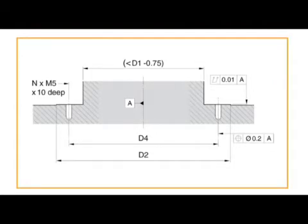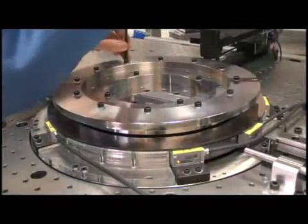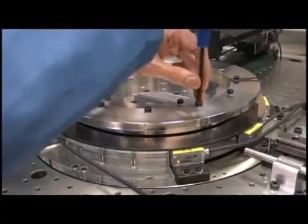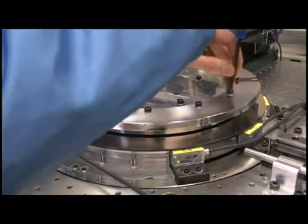We use a tighter spec during the graduation process using highly ground surfaces. The ring itself does not need to be this flat. Early rings were ground to 10 micron flatness. It's found that this was not necessary, as the ring will be consistently pulled to the shape of the mounting surface by the M5 mounting bolts, which exert around 7,000 newtons clamping force per bolt.